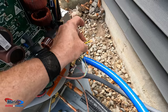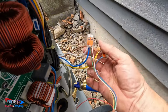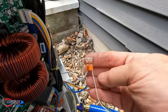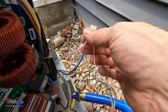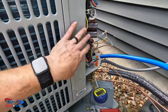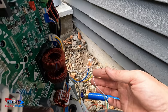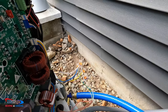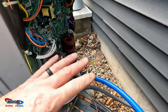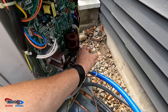I had a comment not too long ago — they were kind of curious on these wires. So on these Bosch heat pumps, the brown is your common, yellow is for your air conditioning, white is for heat, and the B or blue is for your reversing valve. With the heat cycle, once we go in and if it gets too cold out and this thing starts to go into defrost mode, it'll actually kick on the furnace — or your emergency heat — which will heat up the evaporator coil and help keep these lines warm to help de-thaw everything. If I'm not explaining that correctly for you seasoned heat pump folks, leave it in the comments section below, but I'm pretty sure that's how that works.